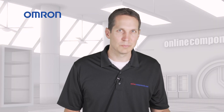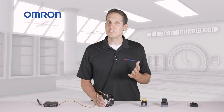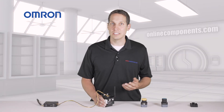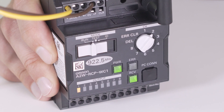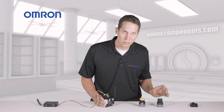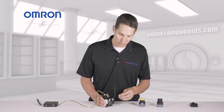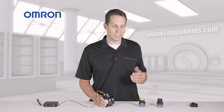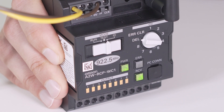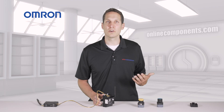It's recommended to make sure other systems in the area are not in use during this procedure, as it may cause problems. Move the slider switch to RUN and start clicking the buttons to watch the different indicators light up. Deleting the buttons and reassigning them is just as easy — put the rotary switch to DELETE and click the button three times until the light comes on. The button is now unassigned and can be programmed to another output slot.